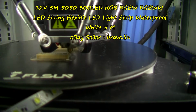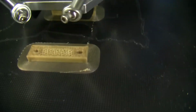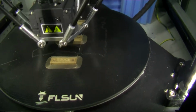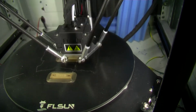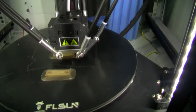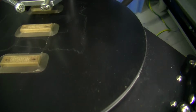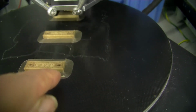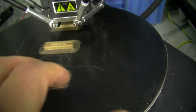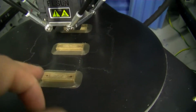100 millimeters per second, 0.2 layer height, 80% infill on this. I want these parts to be strong. I'm printing out the PSU box. Vented box, PSU vented box. Again, at these settings, the other settings we're only prototyping. A few slight tweaks based on the prototyping. These have a slight, oops, almost dropped the camera. These have a slight slot in here so that it can move a bit naturally when you've got it. These are the cable clamps that clamp the cable down.